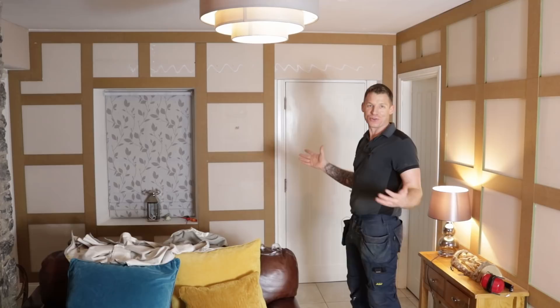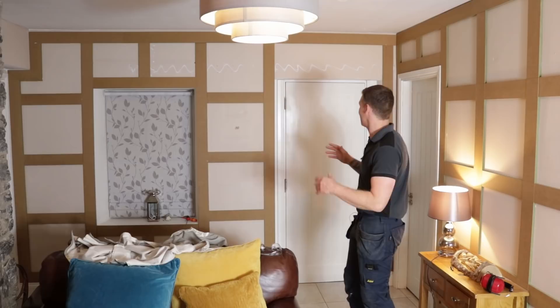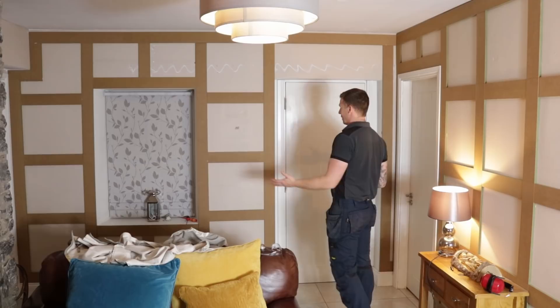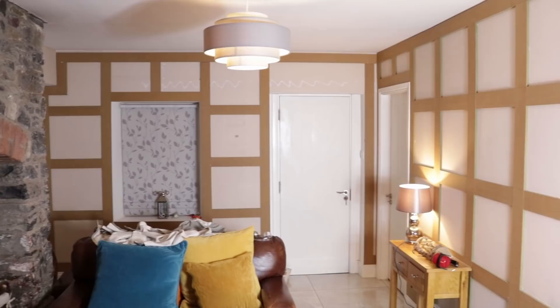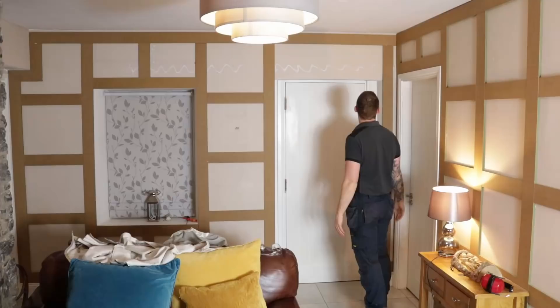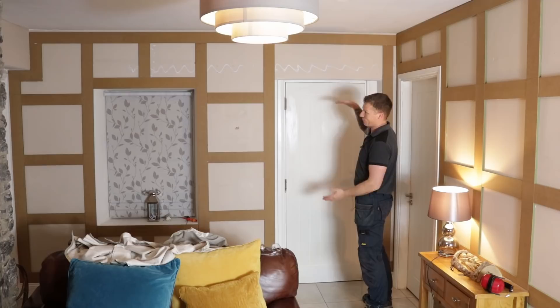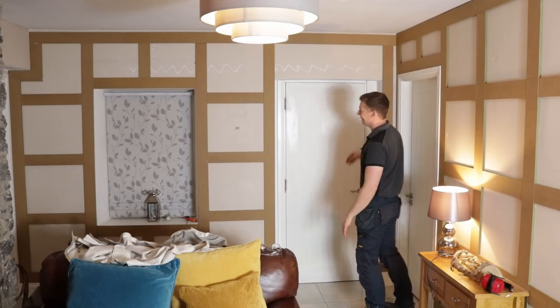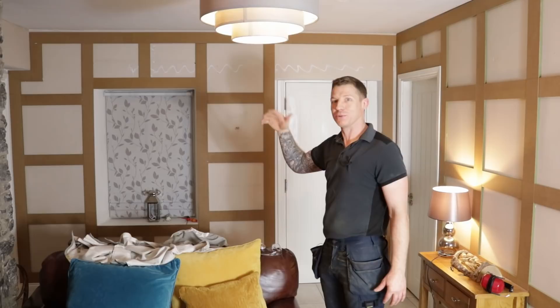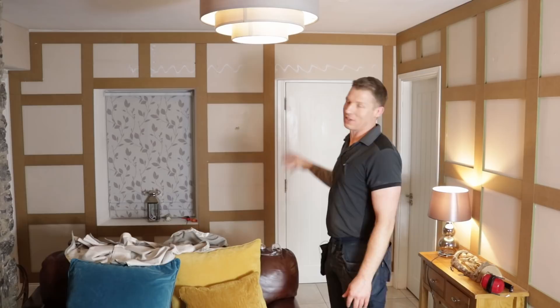Before we finish up, I just wanted to show you this wall. I went ahead and did this — it was quite tricky. I had to make a few compromises here and there — all you can do in an old house like this when nothing is the same. This door height and that door height aren't the same. This door and the window aren't the same height. I have angles to contend with. So I broke it up as best I could — I think it actually looks quite nice. I compromised in the corner and over the door. I didn't put a piece across there the same way as I didn't over the opening. Just a mirror either side. I had to leave a gap — the walls aren't running straight, the ceiling and the floor are meeting each other at one end and separating at the other. Everything can be a compromise with this type of thing. You can fudge it here and there. All the gaps are filled with filler and sealant, everything is sanded down — you won't notice it and the eye will be taken away from it.